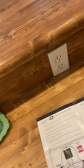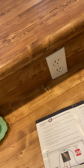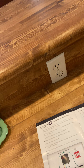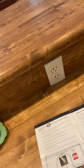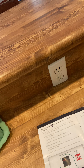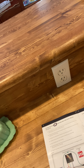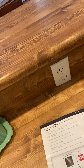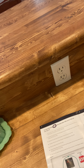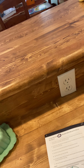When you wire this up above, you're taking 110 to a box, and from that box you're going to run a four-wire. You can do two Romex cables with black, white, black, white, but there's just not a lot of space in that little handy box. I like doing black, white, red, white. Make sure black and white are always your hot and neutral, ground is grounded, and then I use red to red and red-white to blue. If you don't have that, you can reposition your white wire with red tape and use black to blue. Either way, do not mix up your wires or you will blow it up.